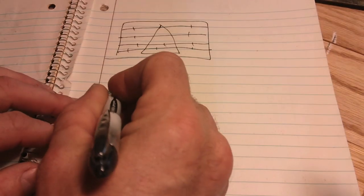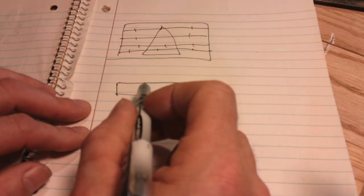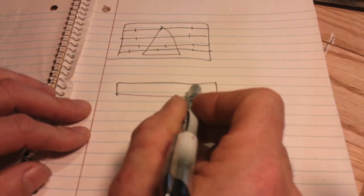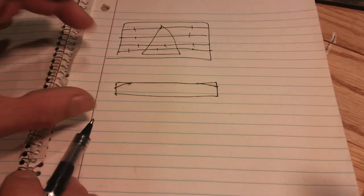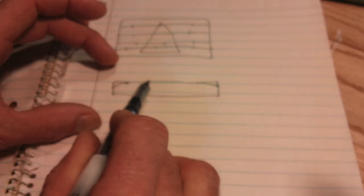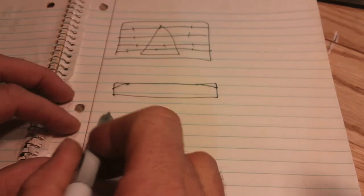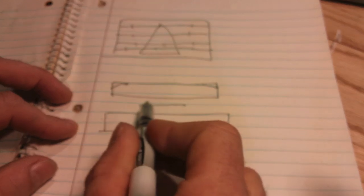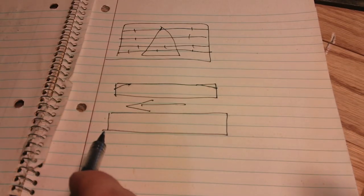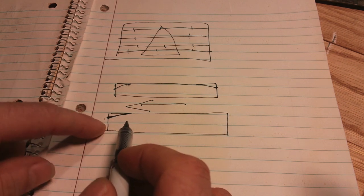Just a couple little tidbits that I'd like to add. What I like to do is I like the ends to be a little short. That way when I squeeze, the centers get real tight and I can squeeze really hard on the outside edges. The only bad part is when you're planing in this direction, I have a natural tendency to take more off the tail edge.